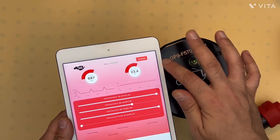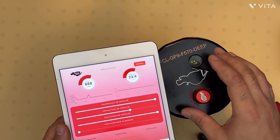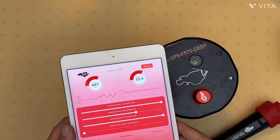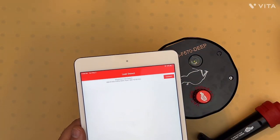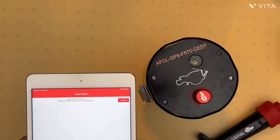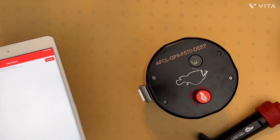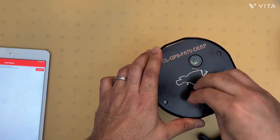Once we're ready to go diving, we can disconnect from the app. Disconnecting allows the circuit to go into sleep mode — it wakes up periodically to monitor for leaks while conserving power. When connected to a Bluetooth device like an iPhone or iPad, it consumes more energy. When we disconnect, you can see the green blinking light, meaning the housing is okay. It's in partial sleep mode measuring pressure, and if the pressure drops, it will alarm out — as we'll demonstrate now by releasing the pressure.